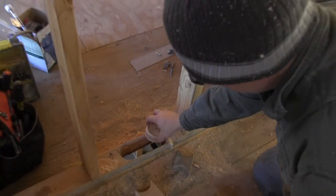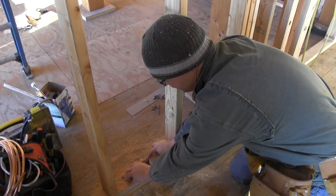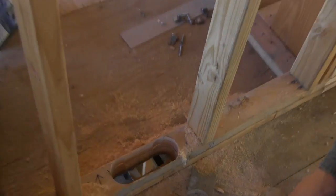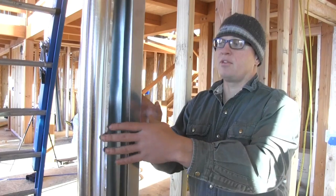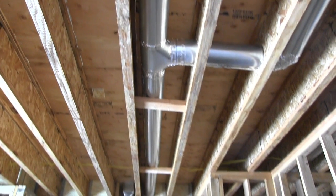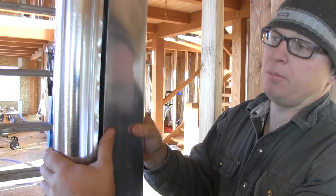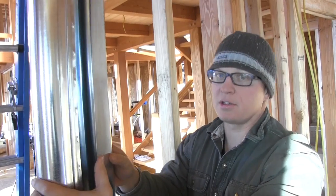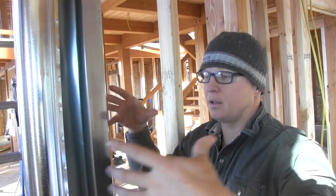To make this happen we had to cut it out with hole saws — you just go ahead and saw that out, it doesn't have to be perfect. The duct will go in there. They make this ductwork so it can fit inside a wall cavity, so you can just sheetrock right over top of it. This is six-inch duct — in the oval shape it still has the same CFM (cubic feet per minute) of air movement. This matches up with six-inch round pipe downstairs that you run in all the joists. When we put this in the wall we cut it to length, snap it together — it's just like stove pipe, it just snaps in place.